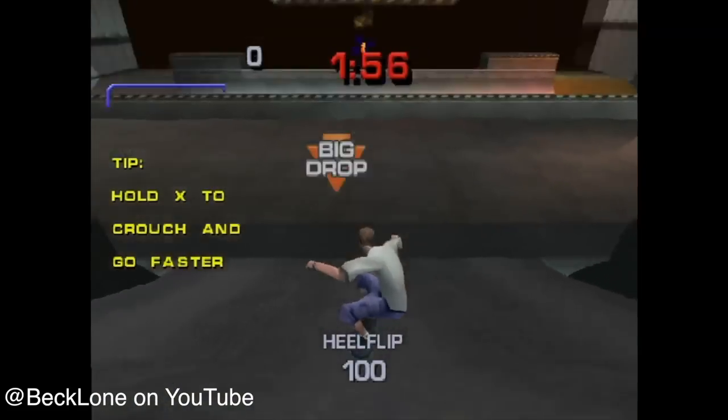Tip number two: make sure your stones are flat. I use this super low-grit stone — I think it's a 400 or 200 grit — as a stone fixer. I have one linked on my kit page. You just rub it against the stone that needs fixing and make sure all the marks go away so it all looks the same color — that means your stones are flat. This is so important because I once sharpened knives with a guy whose stone looked like a skateboard ramp, completely dug out. He never corrected it. With knife sharpening being all about angles, you need that flat plane of reference to make sure you're doing it right.